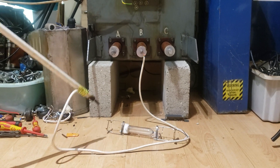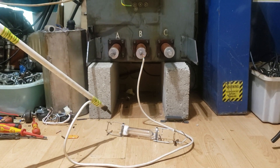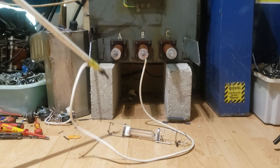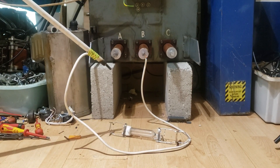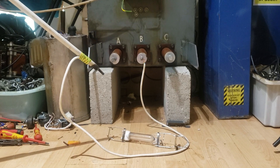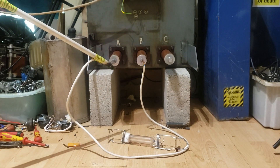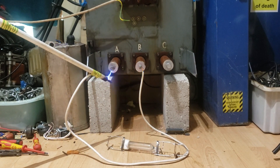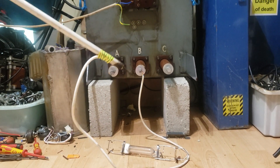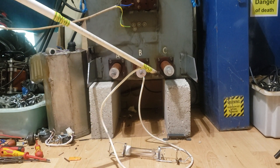I think I can count on this so don't worry about X-rays — I have actually checked, this is not producing X-rays. Right, let's increase the current. Two, three, four ballasts. You can actually hear the difference in the tone of the transformer and you can see the difference in the arc.